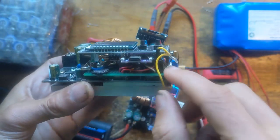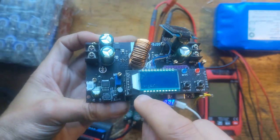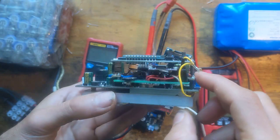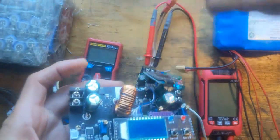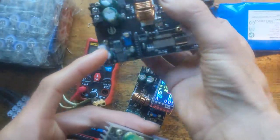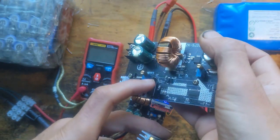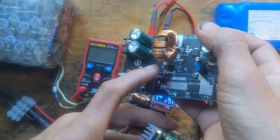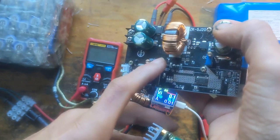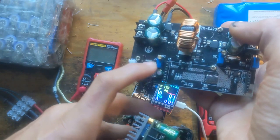I may put it a bit lower so that this ESP32 can go underneath. I go to this potentiometer, and for the output voltage that's the only pin you need to go upwards. The other ones are all here in the header: there's the output voltage, the second one is the output current, and somewhere there are 3.3 volts. The upper pin — if you pull it low, then you can activate the machine.